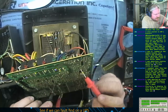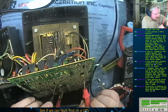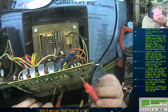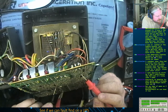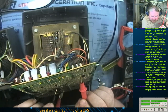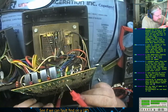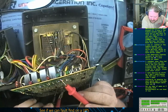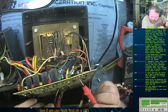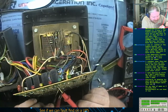So, for those wondering what I'm doing, I am trying to see if... Okay, that chip is getting power. That chip is not. And that's my mystery chip that they scrubbed the numbers off of. Should be getting power. Okay, I am getting power up there to that, which goes to the LED. Okay. And also come this back to this guy, which then goes over to one of the relay coils.